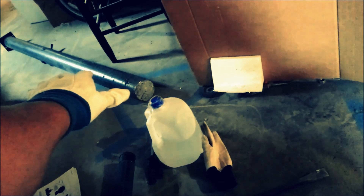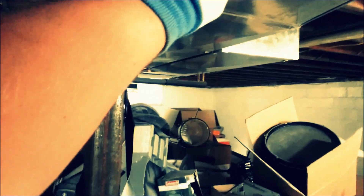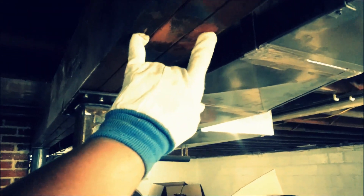One important thing: this post specifically weighed about 150 pounds. Once I knew it was concrete filled, I taped it with gorilla tape back and forth to the new post, so when I did get through the bottom it didn't just fall on me - because the top was only held by two screws and it fell right out.